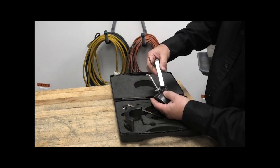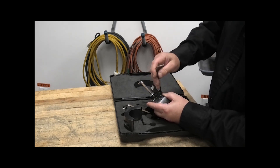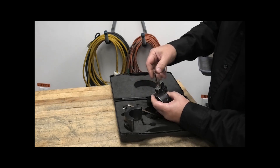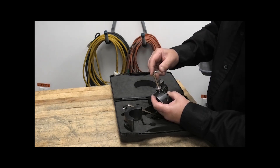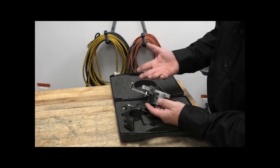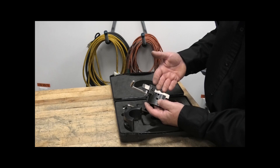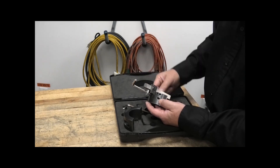Let me put a tool bit in here just to demonstrate. I can clamp this down on the actual boring head. As I make this adjustment it adjusts the tool out — I can move it in about a five-thousandth increment per line, and if I set up a dial indicator I can move it one thousandth at a time and monitor the movement. So this is a fairly clever boring head that allows me to utilize a standard boring bar with just the normal tool slots, and this optional boring head gives me the ability to make this fine micro adjust.